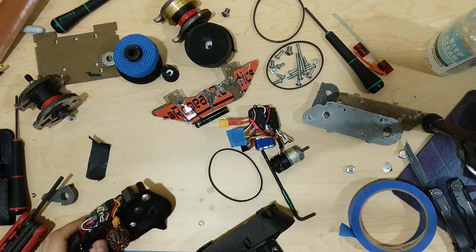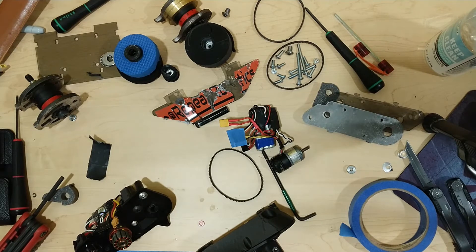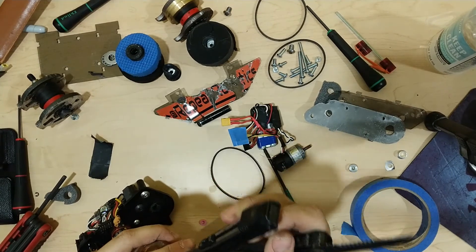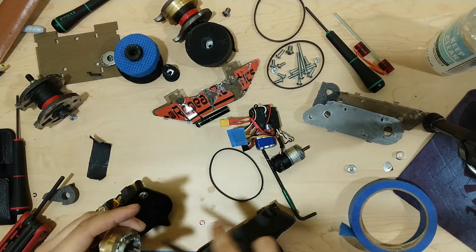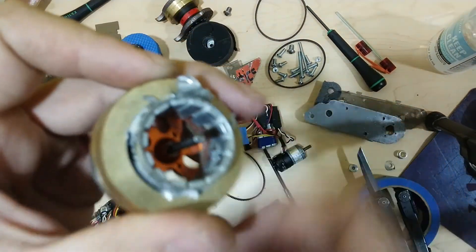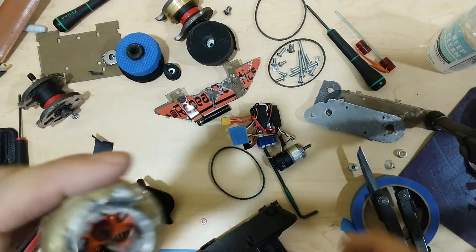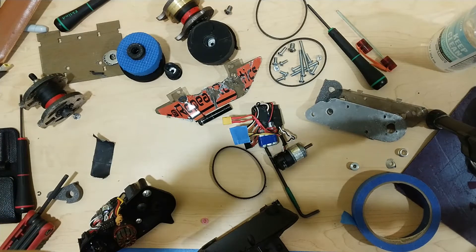This motor is unhappy. Is it full of something? Is that a magnet? Did some lamination come off? There's a piece of metal in here. Oh no — that magnet split in half in the middle. This actually did battle-harden these motors, but that didn't stop this magnet. You have to take my word for it: there's a big chip out of that magnet there — that's where my crunchy motor was coming from. But it wasn't enough to actually cause any real damage.